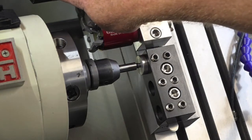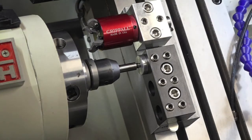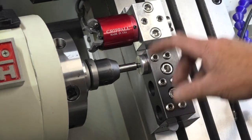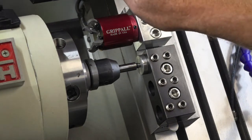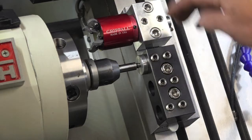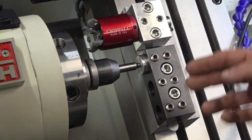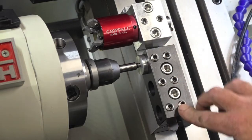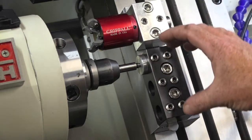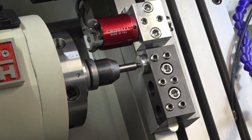Same thing goes for the turret. You just take the slug, stick it in the turret, move it down until it's centered, and all you're going to do is zero out all the X's. For me this is tool number eight, then nine, ten, eleven, and then twelve, thirteen, fourteen, fifteen, sixteen, seventeen. I use the same positions for different drill bits and different tools.